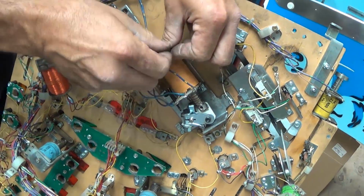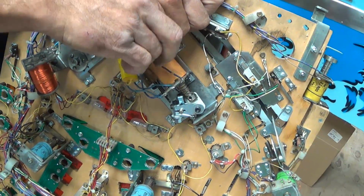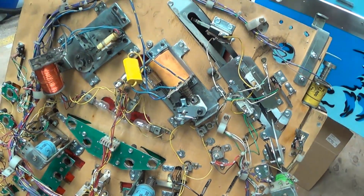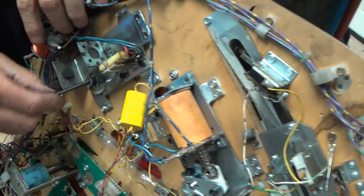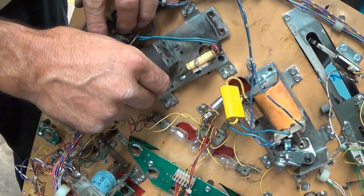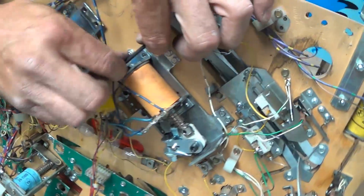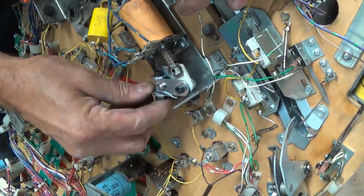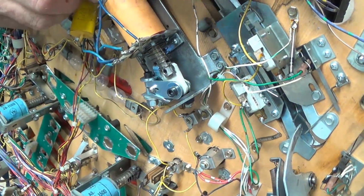So you see a lot of original hubs in the field too, because the guys are too lazy; you've got to take off, like you said, the whole plate to get them off. They wear. Look, it's circular. Oh yeah, and that's shot. You've got a steel shaft rotating, plus it gets dirt introduced into it, which becomes sandpaper to it. Yep. So you have a worn, wobbly hub, like this. We didn't even take this out yet and look at it. There's supposed to be zero play here.